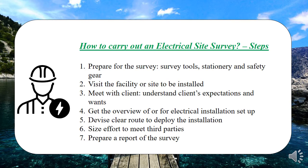While meeting the client, try to understand their expectations and the wants of the system to be installed. The next step is to get an overview of the electrical installation setup. If there's already existing installation work plans and drawings, ask for those so you can understand what the installation will entail. You can also go around the building or the perimeter — for example, if you want to install an electric fence — so you understand exactly where you'll deploy your installation components.